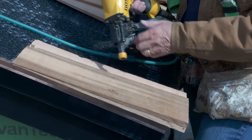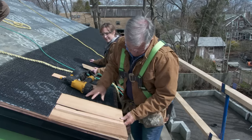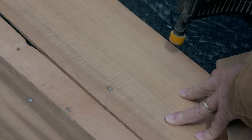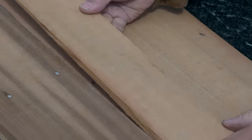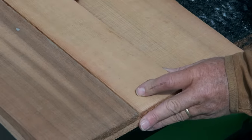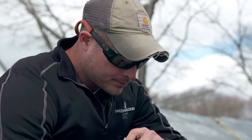We're using a stainless steel ring-shank nail, two and a quarter inches long. Now space the shingle slightly to allow for expansion — keep it the same distance off the fascia board. Make sure there's a gap and that the gap is covered by a minimum of one inch overlap. Space the shingle about an eighth of an inch, because when these shingles get wet they're going to expand and get tight when they swell. Nail up about six to seven inches and nail it off.